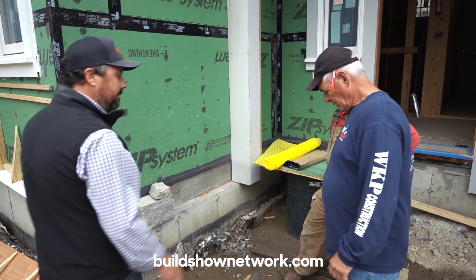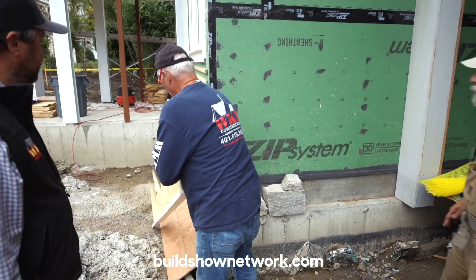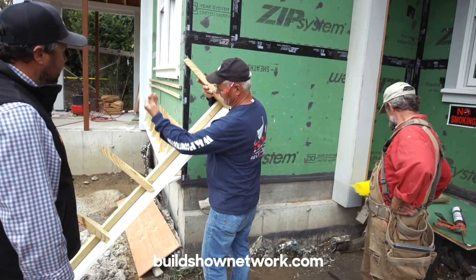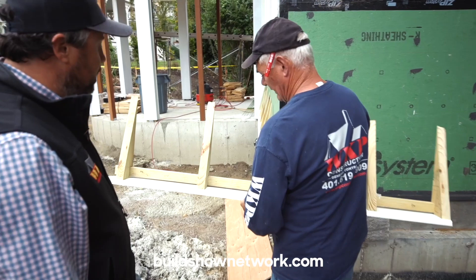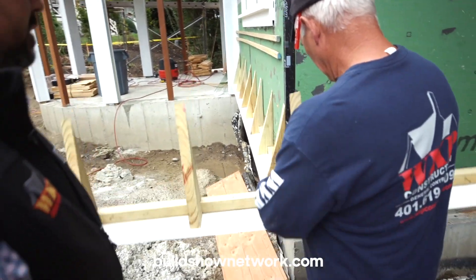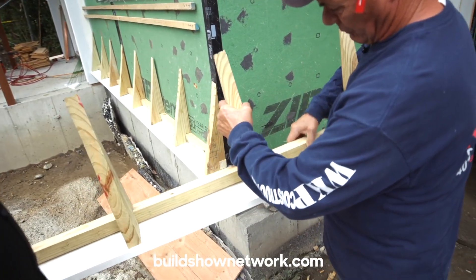Fred, what's the first step? Well, I've got this prefab here — all these blocks, I call them little rafter tails. I got the shape to it, the flare that we want. Is this cut from a template? Yes, we make a pattern and mark every single one, cut them all by hand. Then we fasten it to this PT block which we fasten to the wall after.